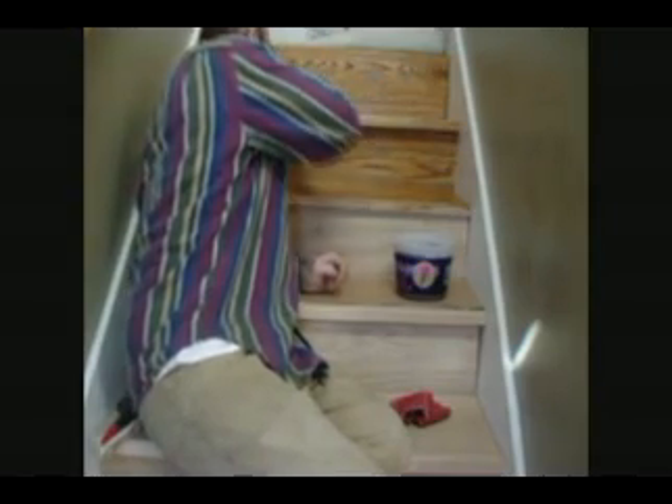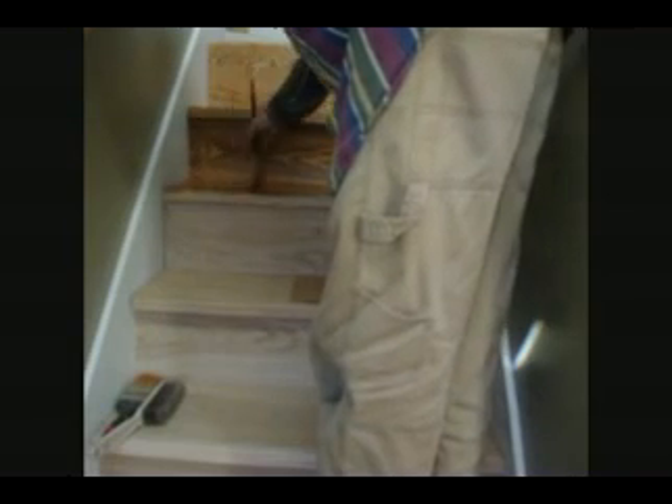I want a little darker color than the Golden Oak but not as dark as the Puritan Pine. So by mixing them, it gave me the best of both worlds. When I deal with this, all I'm doing is putting it on not too thick because you don't want it watery or it'll mark. You want the wood to absorb the stain.